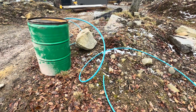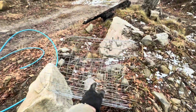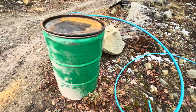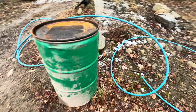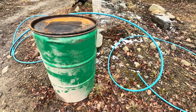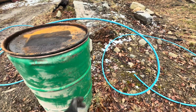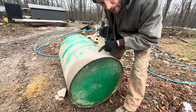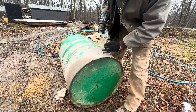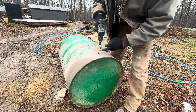I just got done gathering up all the supplies. We have our 5/8 radiant tubing, some wire mesh — actually just wire fencing — and our 55-gallon drum, which was my temporary trash can in the shop. We're going to drill a hole in the bottom and a hole in the top so the tubing can go through. I have some PVC adapter pieces that will thread onto the sides, and I'm drilling one-and-a-half-inch holes so the PEX tubing can go through without sitting on any sharp edges.